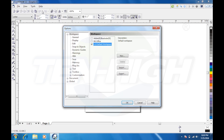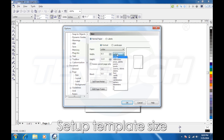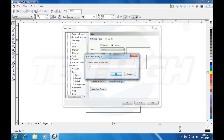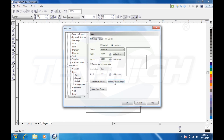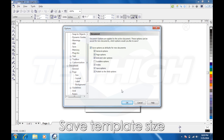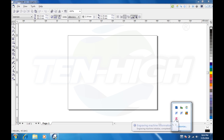Let's go ahead and set up the parameters for the template. This way, every time you open up CorelDraw, it's already set. Go to Page Size and we're going to set it to correspond to the size of our laser engraver, which happens to be 400 by 300 millimeters. We want to save this custom page and make sure that this document opens this way every time. Click this, OK. And that's the size of our cutting area, so we know how much room we have to work with.